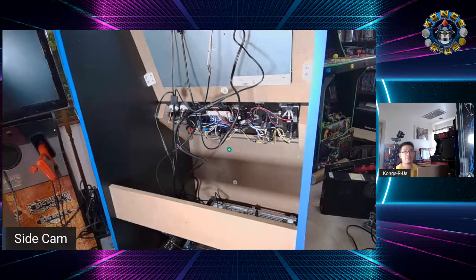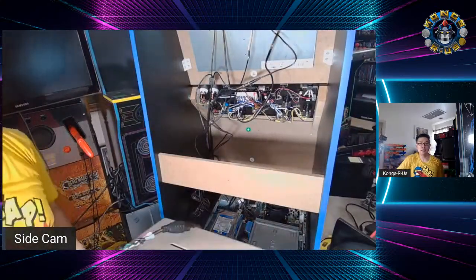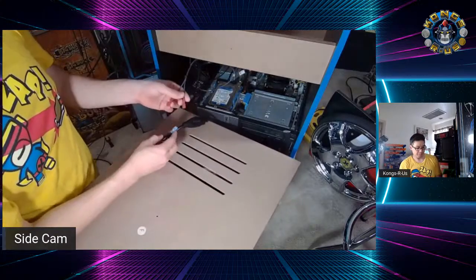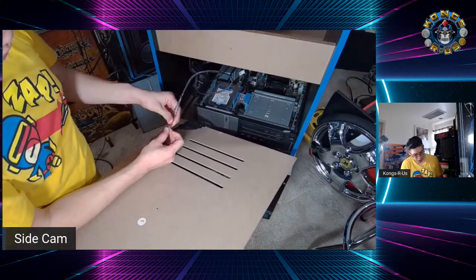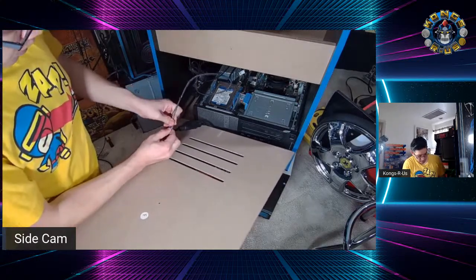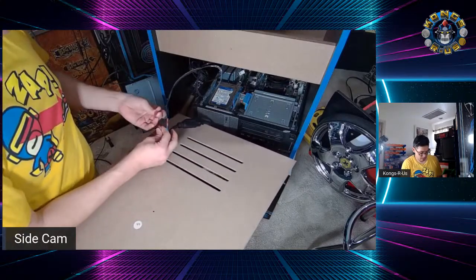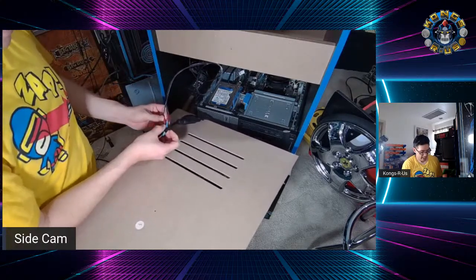All right, so let's pull this back so you can see it. Here is the inlet module switch. I'm going to pull these cables right here. So here's the inlet module switch and the 2 adapter cables. And it doesn't matter which one you do. All it's doing is bridging the black hot wire connection that would normally be going into this female adapter extension cord and the inlet module switch. So it doesn't matter which one you plug it into. It's just bridging. It's essentially just making a connection for the hot wire there.